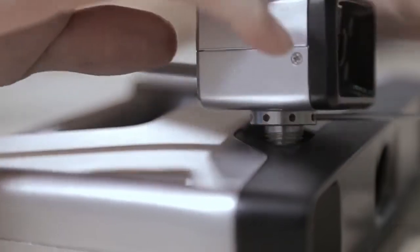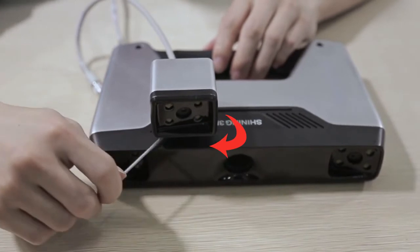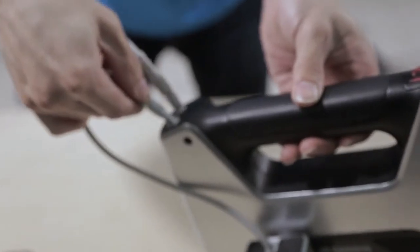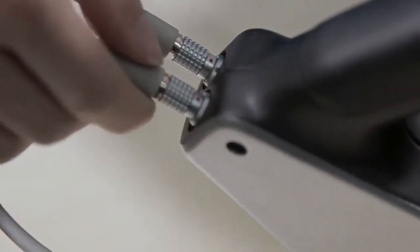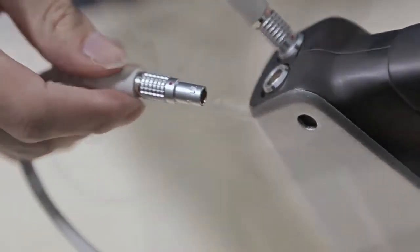The camera direction is the same as the other two on the equipment. Then, insert the hex wrench into any one of the holes and tighten the screw. Insert the wire on the camera to the scanner where 'camera' is marked. Please pay attention to keeping the red point upwards. Align the convex part to the groove of the scanner. When you pull out the plug, please put your finger on the textured part.